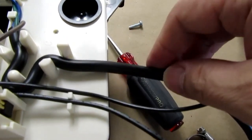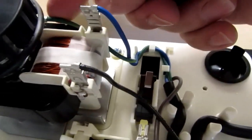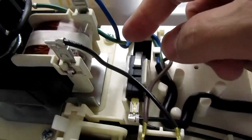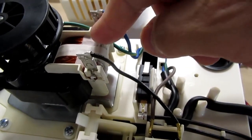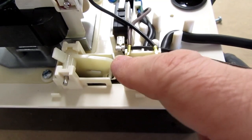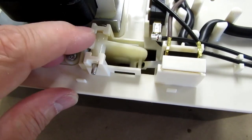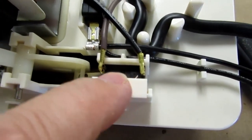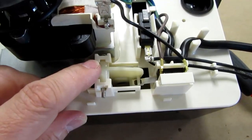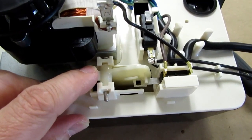Anyway, here's the power cord coming in, and it goes through a strain relief. The ground goes to the only metallic thing on here, which is the housing of the motor. It doesn't go anywhere else. And the neutral goes through the blue wire to one side of the motor. The brown, which I believe is the hot, goes through. This is the primary float switch here, and that operates this switch. So the hot comes in, it goes through the switch, and then it goes to the other side of the motor. So when the level rises to high level, not high level, just regular high level, it operates the switch,